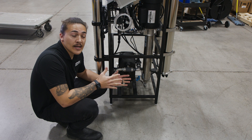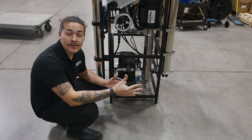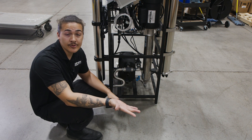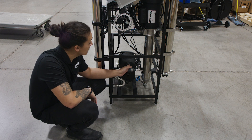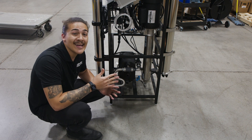Now at this point in the process, we've filled an atmospheric tank, hot liquor tank, or cold liquor tank with purified water. From here, we may need to deliver the water to other points of use or service. For that purpose, we've included an onboard delivery pump — a Grundfos Scala 2, capable of pumping up to 22 gallons per minute at 60 psi.